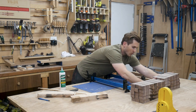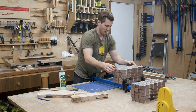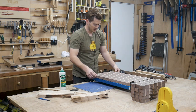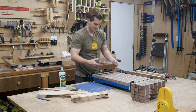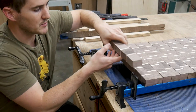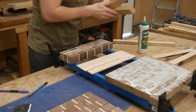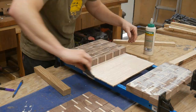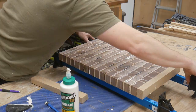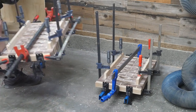So I'm going to take the walnut pieces that we cut to length and just lay them out on the board here. Now that all the pieces are laid out, what I'm going to do is flip every other piece. The reason this design works so well is because when we originally built these, they had a bunch of two-inch pieces of walnut within an end piece that was half that length. So by flipping them over and combining them together, it gives this offset brick pattern. Then we're going to take the maple strips and insert one in between each of them — it's going to fill the void and make it look like mortar with bricks.